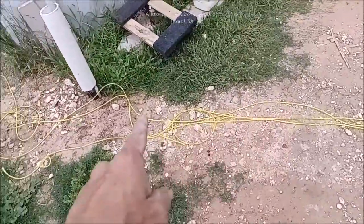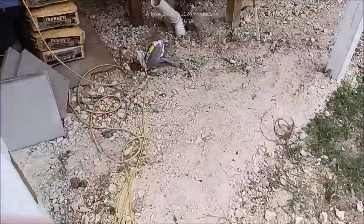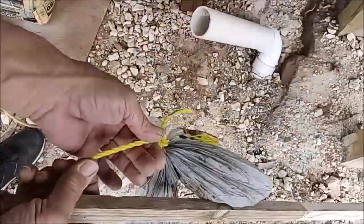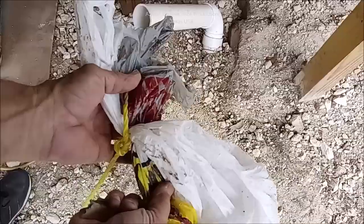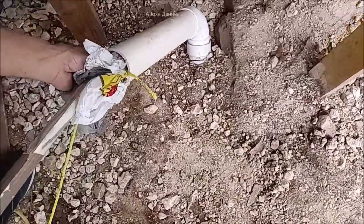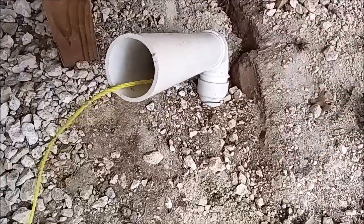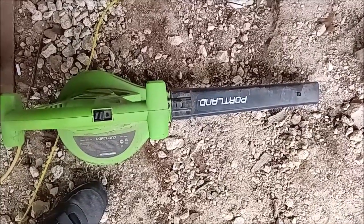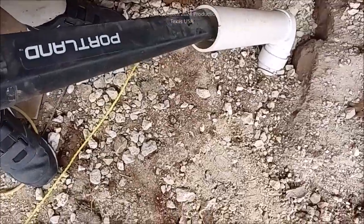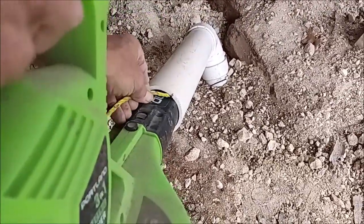Back here I've taken the poly rope and laid it out in a long loop because when this thing takes off, it's going to take off fast. I'm going to tie the poly rope to two shopping bags, shape it like a little bullet, put it in here and get it past that 90-degree fitting, then use my blower. This thing really blows - it's going to be loud. It goes into that three inch pipe - you can see the gap there - and that gap allows the string to go through.